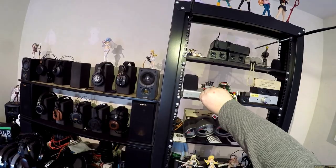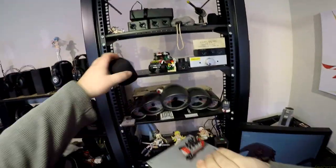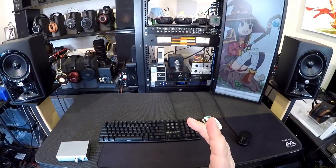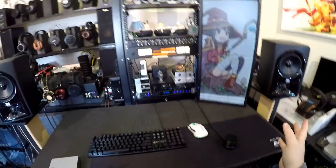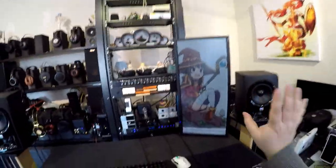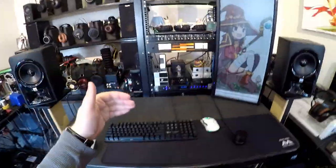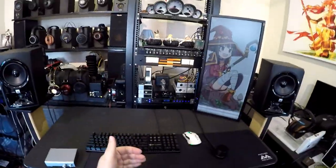These speakers take a 1/4-inch input in the back, which you can buy, and I'll link in the description. I haven't hooked up XLR. You don't need to know what that is. If you're a novice, you don't need to worry about it. You can get these to work on anything. Your old iPhone could play on these with the right wire. I will list in the description a ton of wires you could use to hook this speaker up. 3.5mm to XLR, which you would just pull the XLRs apart and plug one in here and one in there, and you'd have a split. And then you'd plug 3.5mm into your laptop sound card and you'd be golden.